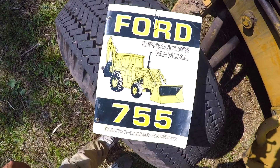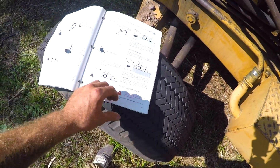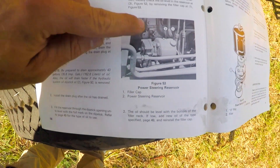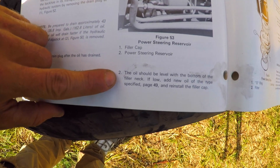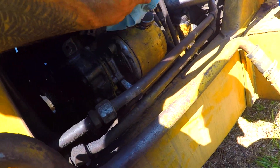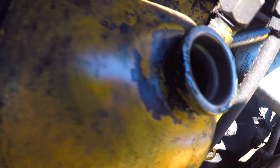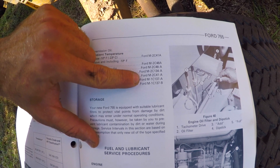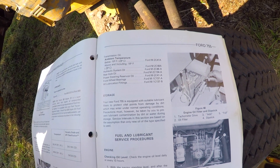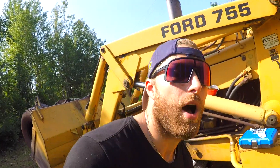The next thing to take care of is the power steering hydraulic oil. Fortunately we have a beautiful operator's manual from 1979 — on page 56 it shows the power steering reservoir and filler cap, and it says the oil should be level with the bottom of the filler neck. I looked yesterday and there is absolutely no power steering fluid in there. The spec is Ford M2C41A hydraulic oil, and Tractor Supply has the right oil with that spec on the back label.